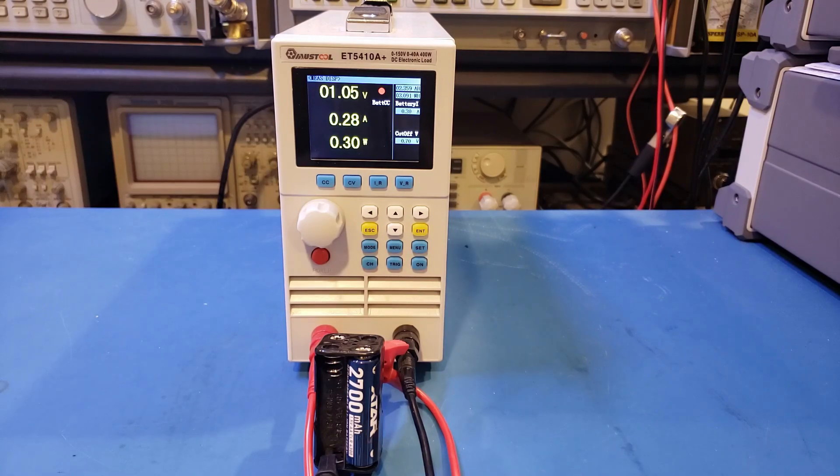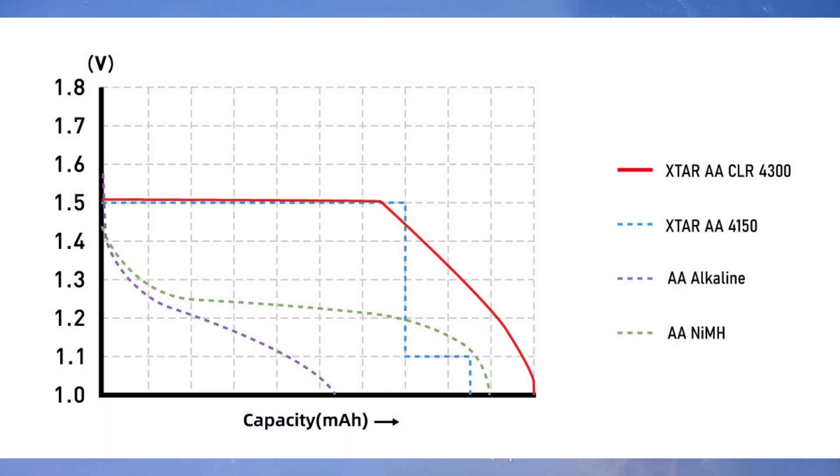The video clip I captured here doesn't do it full justice. The voltage drop is actually quite gradual, occurring over a long period of time. I have definitely observed this gradual change in terminal voltage. This redesigned discharge curve allows battery monitoring circuitry to give a much better estimate of the actual run time. Definitely hats off to the designers at XTAR.